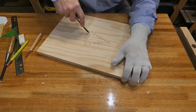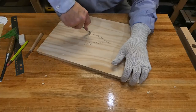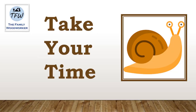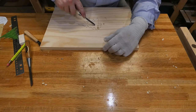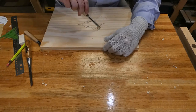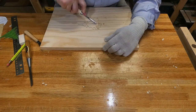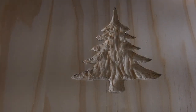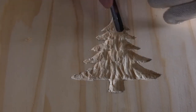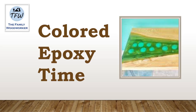I watched a couple of YouTube videos to help me out. The technique is to get started at the bottom of the drawing, take your time, and once you have that bottom carved out, work from the opposite angle and gouge material toward the open area you just created. That helps prevent additional tear-out because the tool will gouge up to the point where you previously carved. I got to a good result — I didn't need the inside to be super clean, but I wanted the depth to be as equal as possible since I was going to fill it with epoxy.